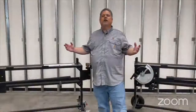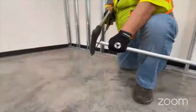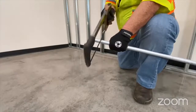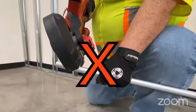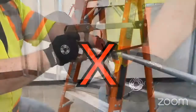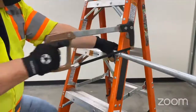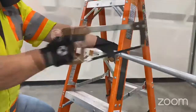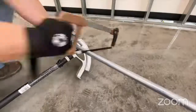Another task when you're running conduit is you've got to cut it. What kinds of things are you seeing when you walk around a job? You see the old standby — the on-a-knee method. Here we are, bent back over again, straining our back. Do not do this. And a crooked ladder — that's a little bit better than what we just saw. When you start to shake your ladder, it's not completely stable. This is a method one of the old-timers taught me when I first started out, using the hole in the bender.